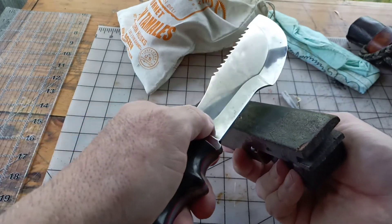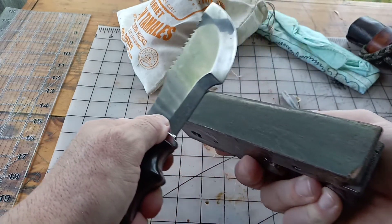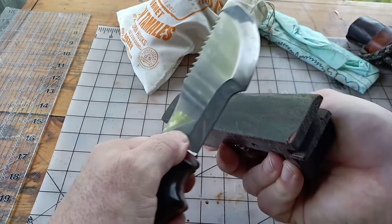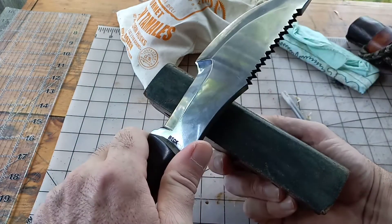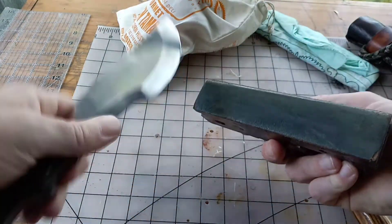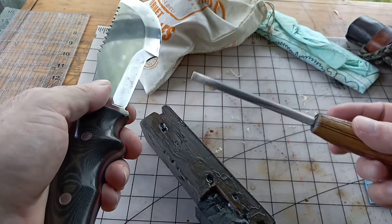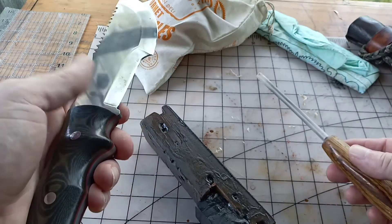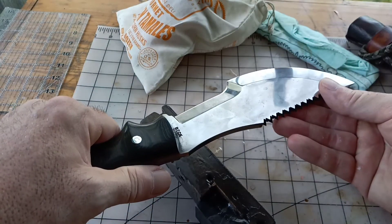Leather is glued to the top with green rouge, and one side is rounded. When dealing with the WSK or tracker-style blade, when you're stropping you can get up into the curve — both sides. The round ceramic rod works great for getting up into that curve. I really just have not needed to sharpen this very much — it's held its edge fantastic.